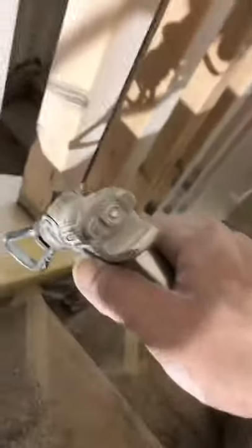Once we have it all taped, this is where we start laying down the primer. I use a solvent-based PX primer with a 1095 diaphragm pump and a Titan 308 fine finish tip. I really like these tips — they work great for smaller areas like this. The fine finish with a 3 for the smaller fan and an 08 orifice means I'm not pumping too much on there. We prime it all and it gets two coats of primer with a red and buff in between each coat.